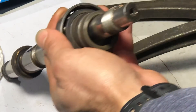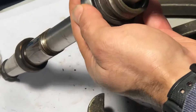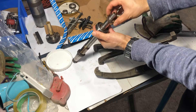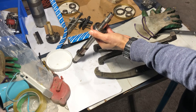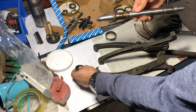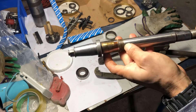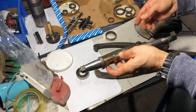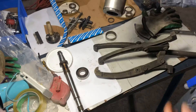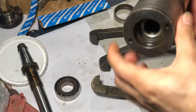Taking my gloves off. You see, if I pull it, it will go out. This one goes in here, and this one is the middle ring. It shouldn't be this way, but I guess they know better. So this is the shaft — I finally took it out and it's in pretty good condition, so I'm going to buy new bearings.